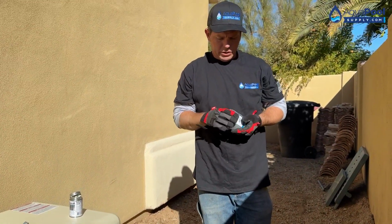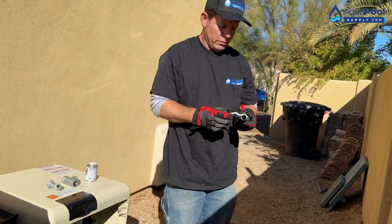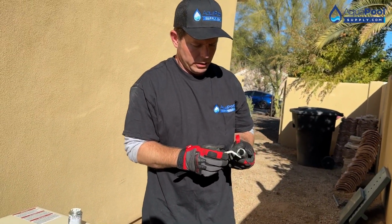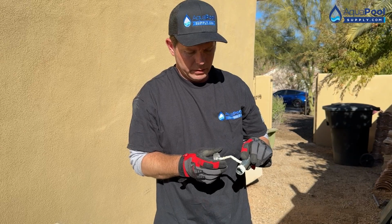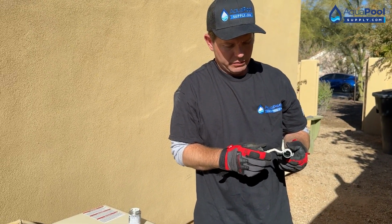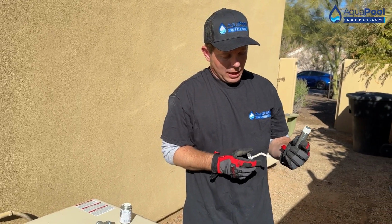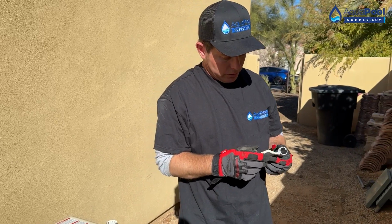Now we'll do the sediment trap coming right out of the unit. We do the sediment trap right outside of the unit, coming directly off of the pipe. Basically that's just for any kind of residues or buildup, stuff that gets by, the blow-by in the pipe. It'll drop down into this capped line before entering the heater.